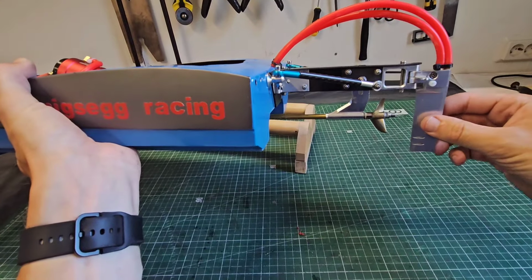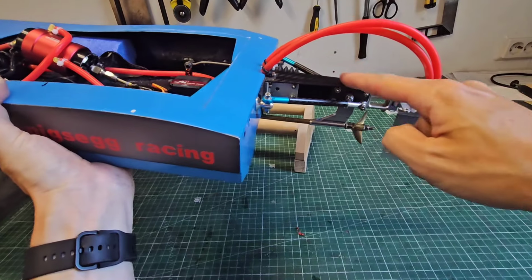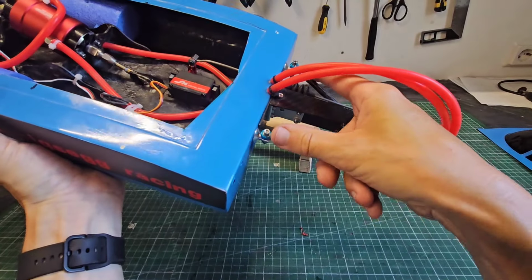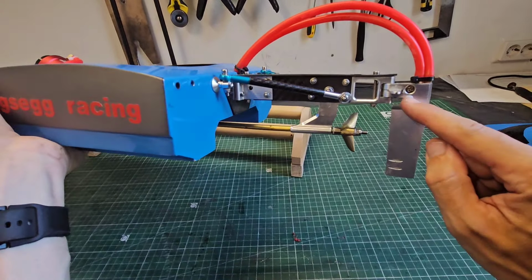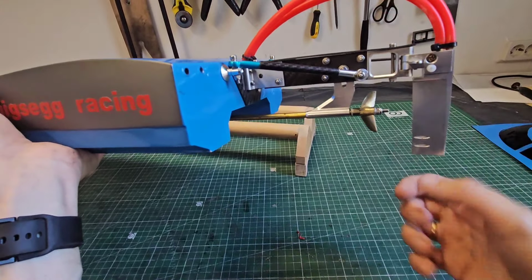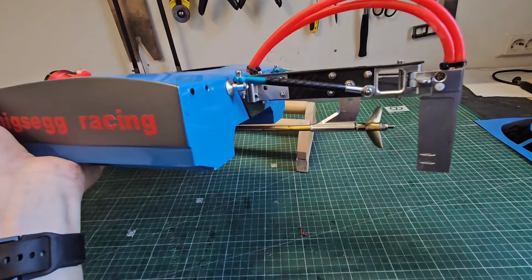And then it has a center mounted rudder, which is behind the prop. So altogether, this is a pretty long rudder arm and it has some braces to stiffen it up. And it feels nice and strong. I put a plastic breakaway bolt here myself, so it has a kick-up rudder. In case you hit something, this plastic bolt will break and the rudder will kick up.